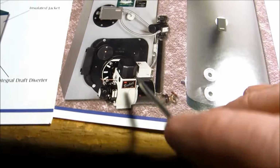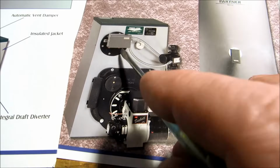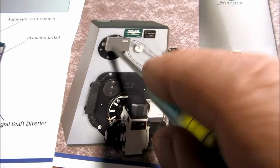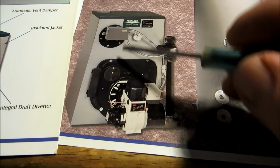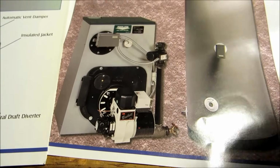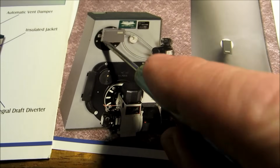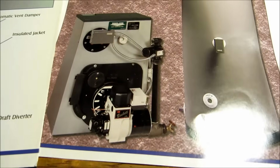This particular boiler, you can get either with a tankless or without a tankless. If it was without a tankless, it'll have just a black plate, and the control will be different. The control will be strictly a high limit. It's what I would call a cold start boiler if it has no tankless. It only would fire up for a call for heat, and other than that, it will cool off. With a tankless, it'll maintain temperature, whatever you set the low limit at.